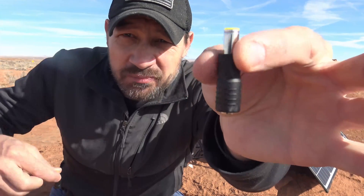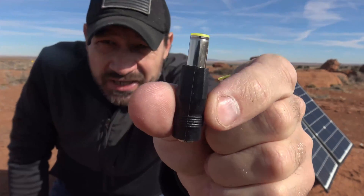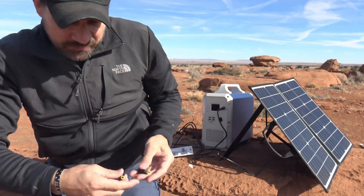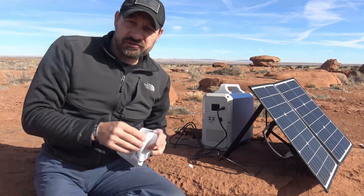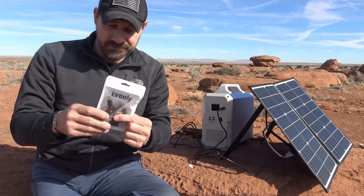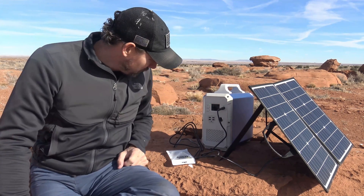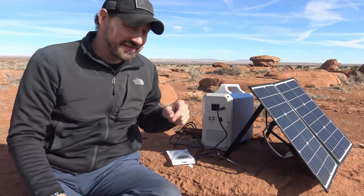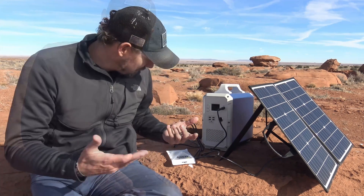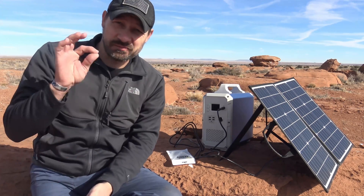Here's the original adapter that came with the panel and here's the replacement. You can see these are kind of a squared body look. That's what the problem was. Now some of you are probably thinking the company should warranty that — well, of course they should. But I do a lot of stuff like this, so for me it was no problem to drop $10 to pick up some of these adapters. Right now I'm pulling 40 watts, and that's impressive. This is a fantastic panel — it's very small compared to other 60 watt panels and it packs a punch. To be able to see an input of 39 watts with cloud coverage, that's impressive.